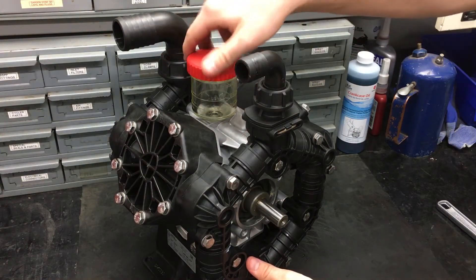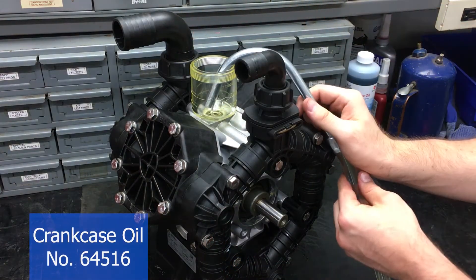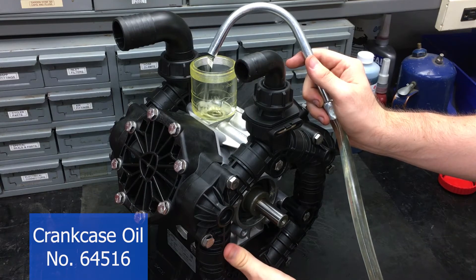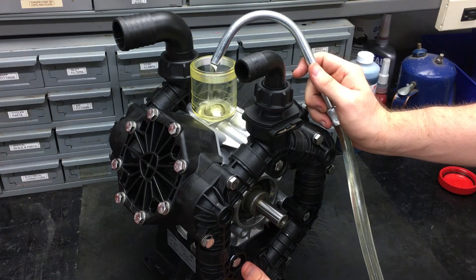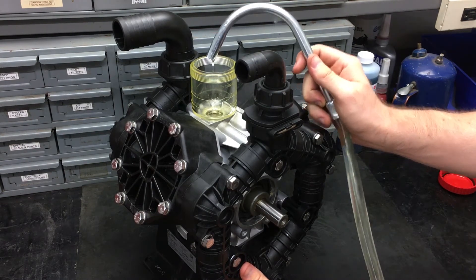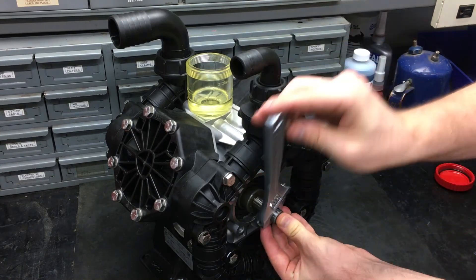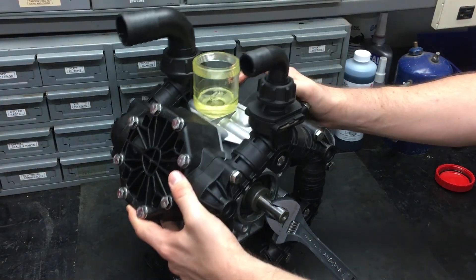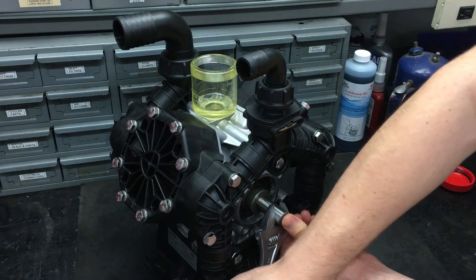To finish servicing this pump, oil needs to be put back into it. Start by unscrewing the cap and O-ring, then adding a small amount of your oil to it. Attach a wrench to the crankshaft and twist it back and forth along with rocking the pump side to side. This allows the air to float up and out of the pump. Make sure all air has been removed from the inside, or it will damage the diaphragm like the broken one shown earlier.